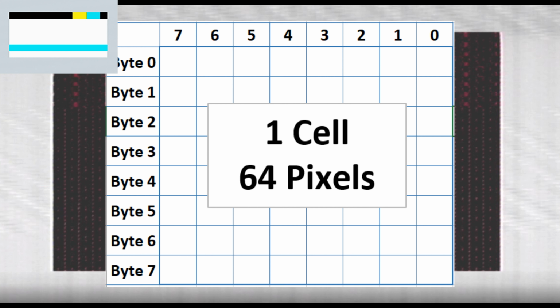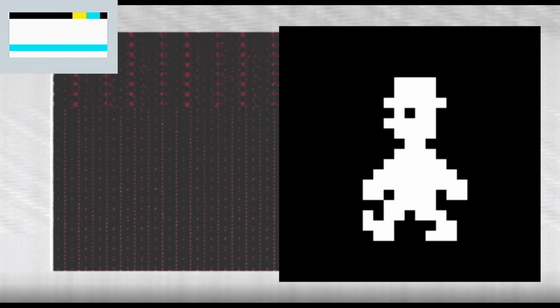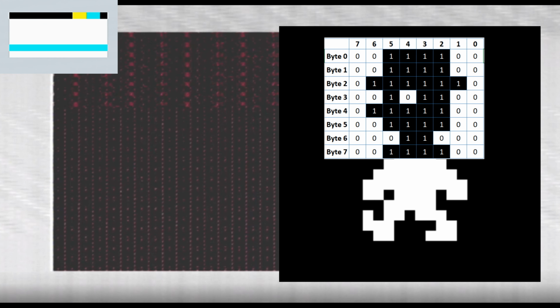The actual pixel data, which we're looking at here, is extracted in a different way from memory, from a different location. So I think we're going to find a problem with that bit of our circuit. This pixel data has to be sent out one bit at a time, one pixel at a time, in sequential order, so the scan line can output what we're seeing on the screen from left to right. So that's really important, that has to happen sequentially.